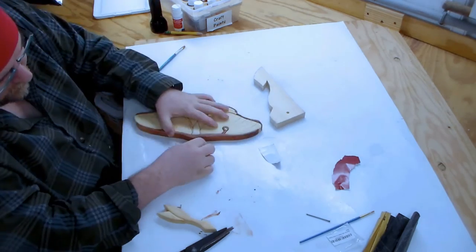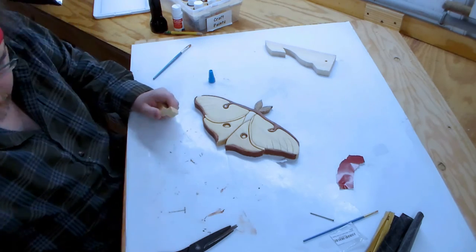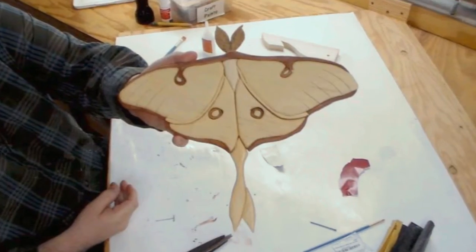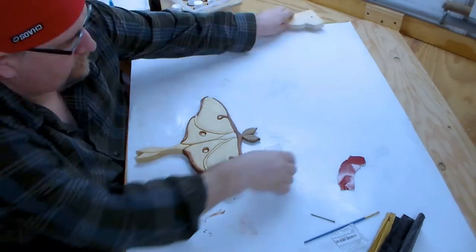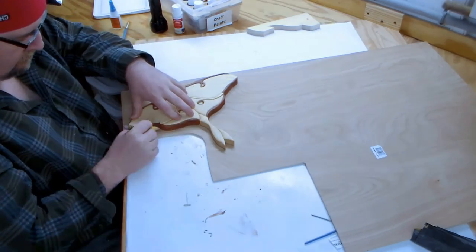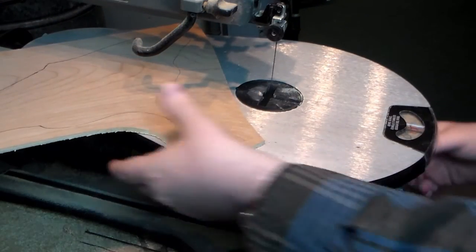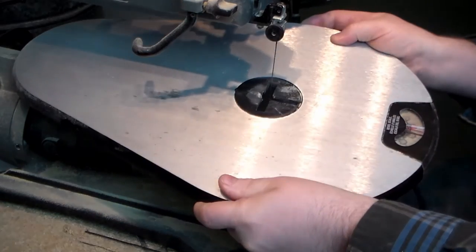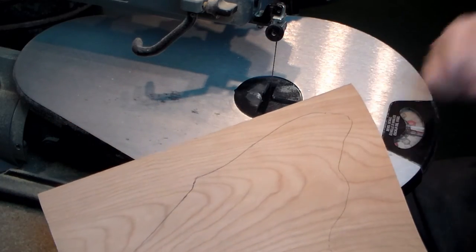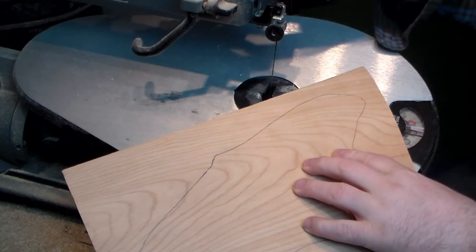I'm drilling out a hole to put the antennae in and then attaching the long tail. After that I'll get out a sheet of quarter-inch ply so I can attach a backer board, tracing around it and then cutting on the inside of that line. To cut the backer board I tilt my table to a fifteen-degree angle so it's sort of recessed. I find it better to cut inside the line, take your time, and then attach it with wood glue after.